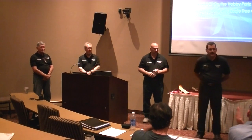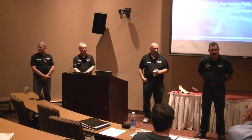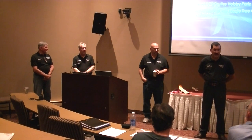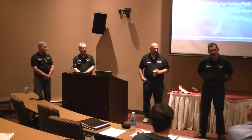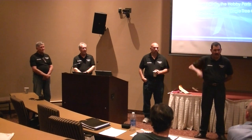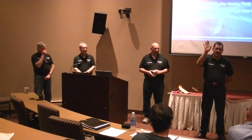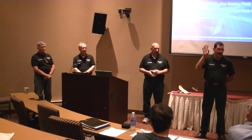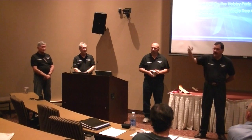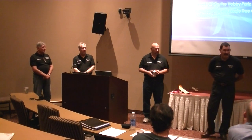Point to it, or is it just going to be squirrely? If you wanted to have the ailerons enabled, you could. Some of the more advanced SA models do have ailerons, and they even have flaperons. So you could take this gyro and hook it into your flaperons or ailerons, and then control the roll, which would stabilize even the third axis on this thing. This particular model only has rudder and elevator, same with this one, and it seems to work fine on this.